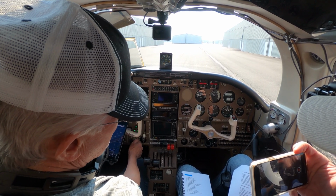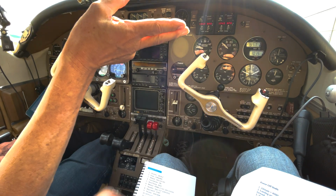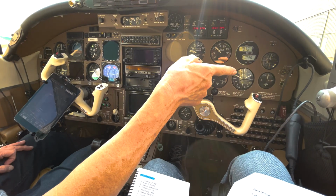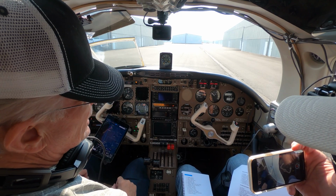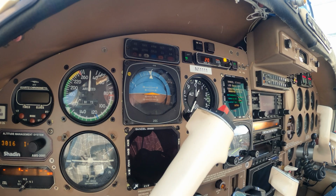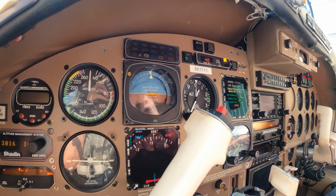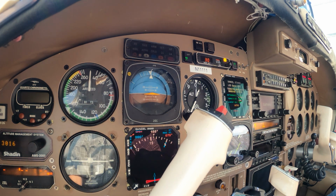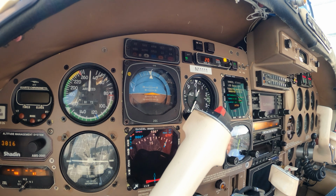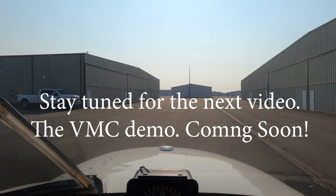Okay, boost pump to low, and we got pressure. Boost pump to off, so the engine-driven pump's got pressure. We still have hydraulic pressure. Both of these little red indicators are out. So I'm going to go ahead and arm the aux hydraulic. We'll turn both the radio master and the autopilot master on, and now I'll go ahead and do test. Do that. Oh, and I have that crazy alternator whine, loud as can be. And you probably should figure out right. Works fine, so.